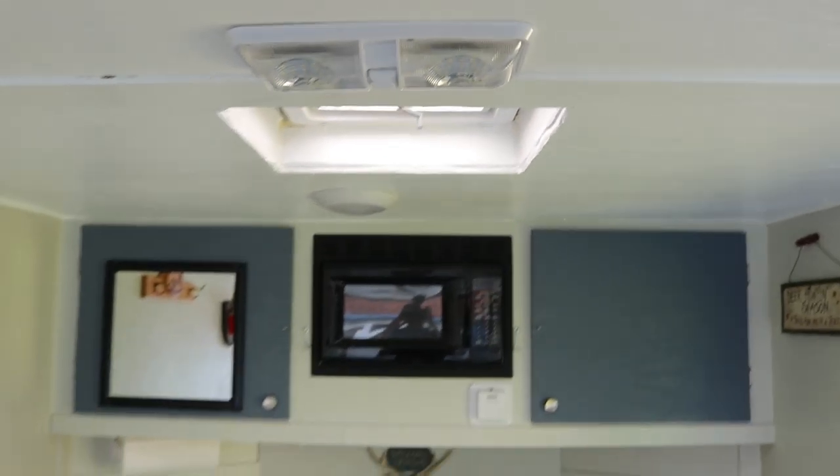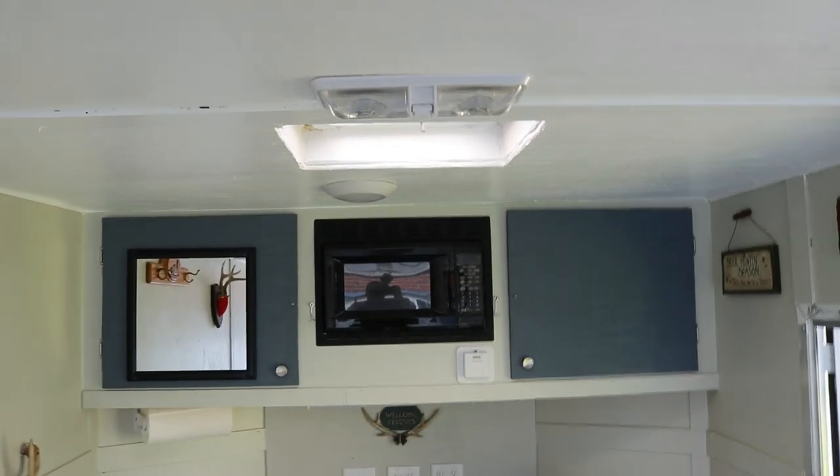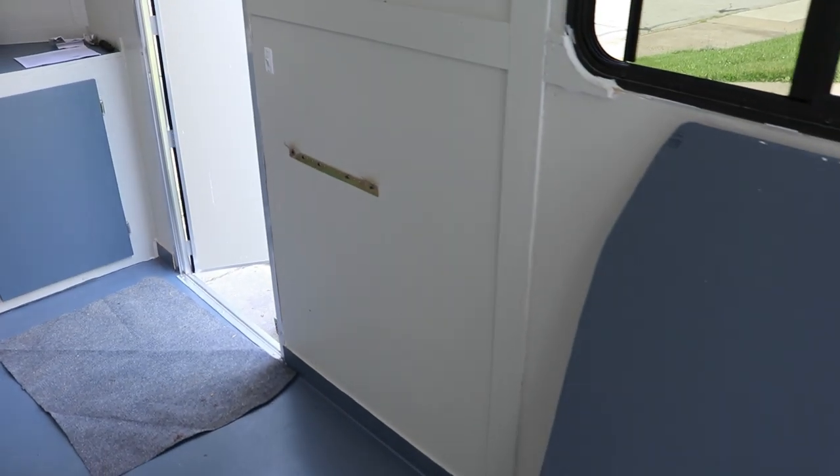The center lights are a little off-center because the first thing I did in here was rip half the walls down — I took the top section off on this side all the way around, and the lower section on the other side because I didn't want to mess with the window. That let me slide one-inch insulating foam board up behind there — I believe it was an R5 value — so not a huge R-value but it's a lot better and a lot quieter in here.